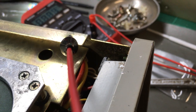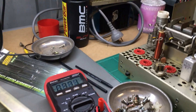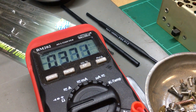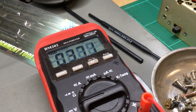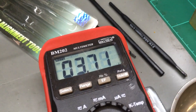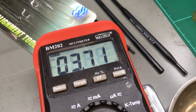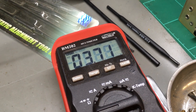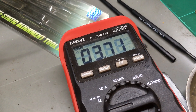The test is to start with the clarifier on and check a reading — we have 3.71 volts. Clarifier goes off: 3.71 volts. So we are in alignment. That's for receive. The last thing to check, and I'm into a dummy load here with the heater off.